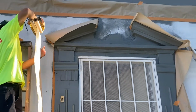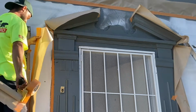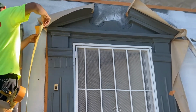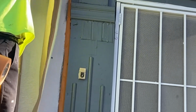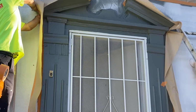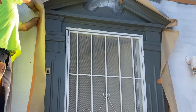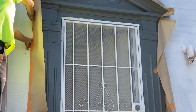Sometimes on older buildings, the edges where the wall and door frame or the wall and window frame meet create corners that can be rotted or dug out in places. Placing a single strip of painter's tape over these corner edges helps the tape to fill the gaps and act as a smooth corner or edge. Then you can mask it over easier and get a straighter, smoother edge.